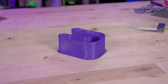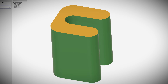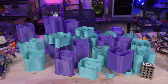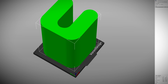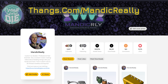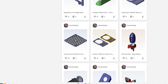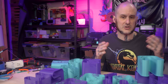I ran one flow rate test in the last video using a file downloaded off Printables, but I wasn't happy with it, so I jumped into Fusion 360 and created my own racetrack design. I didn't invent the concept — I just created the specific geometry to fit the Voron V0 build volume. The goal is to keep the print head moving in a straight line as long as possible so it can fully accelerate and achieve maximum flow. There's no slicer button for this setup; it gets complicated, so I've included a link in the description to both the STL and the actual G-code I used.